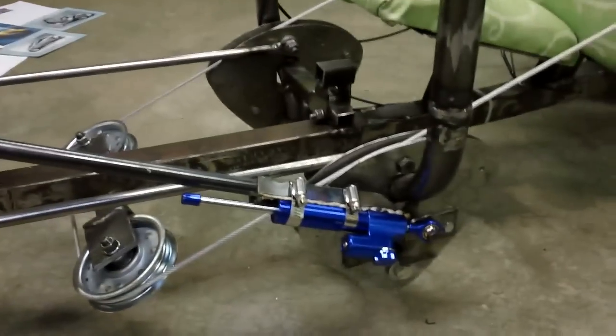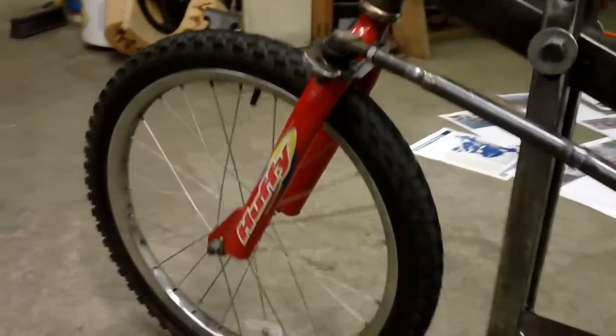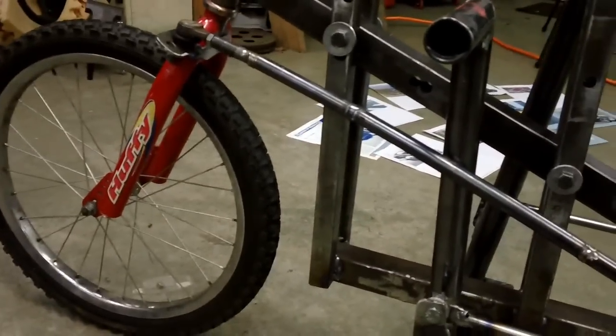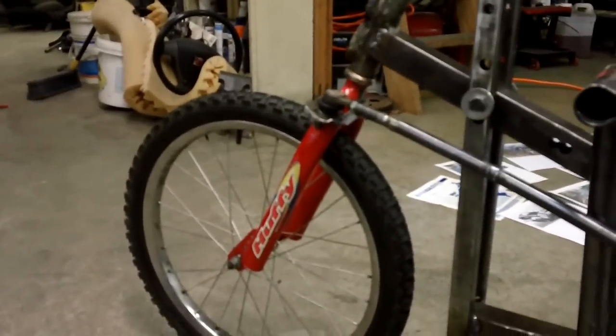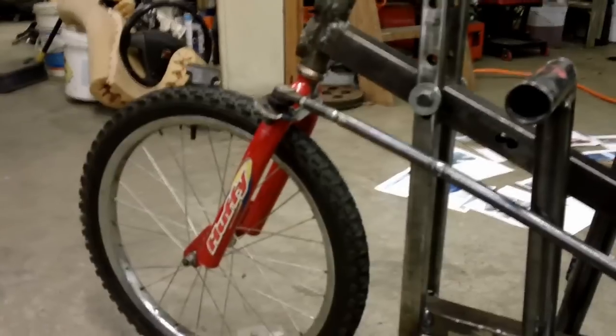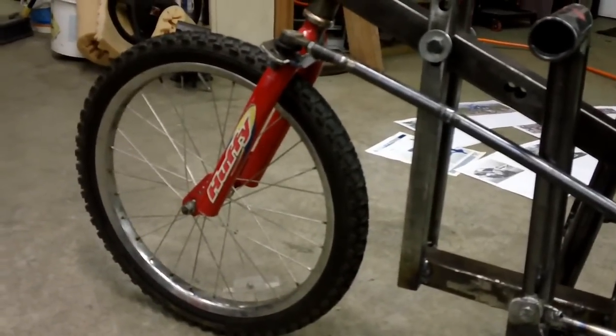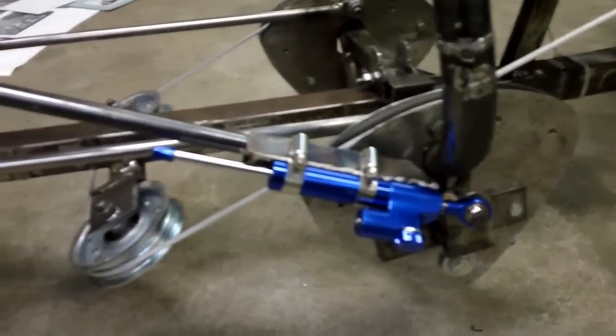What's neat about this dampener, and Tom Blackburn is the one that figured out that you need to have this, is that when you are in control, when you are steering the vehicle over here, let me loosen this. So when you push it, and you can see how the wheel is turning back and forth, as you try to make a right-hand turn, you push the wheel to the right, but it is through the dampener, and so it allows the front wheel to counter-steer just enough to work. The front wheel wants to go straight, and as you turn, it'll kind of be left behind just an instant to get you off balance and then to move into the turn, and it works great. But you do want to adjust the dampening force over here to figure that out.